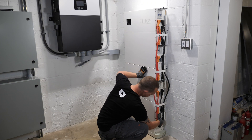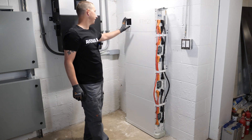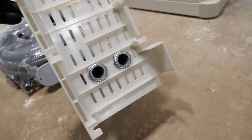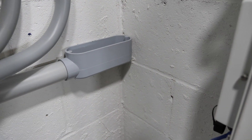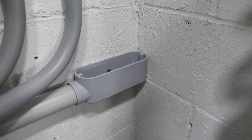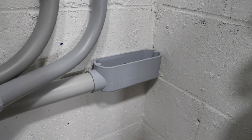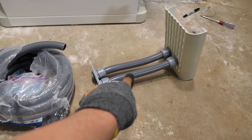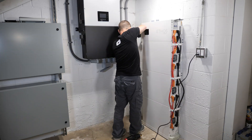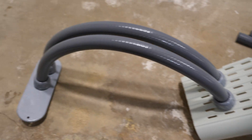I'll close the circuit breaker covers and tighten the thumb screws on each battery. We do need to shut off the controller unit because we still have to connect the battery cables over to the inverter. The way I had it set up before was cutting holes in a side cover for flexible conduit — two pieces going through an elbow over to the bottom of the inverter. I'm doing roughly the same thing, but I rotated the elbow up so the conduit makes a nice bend down into it. I need to swap out the shorter conduit pieces for longer lengths.